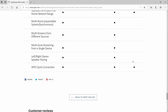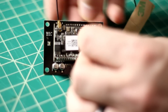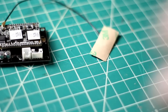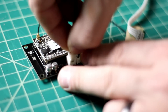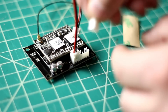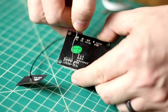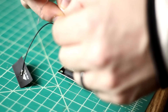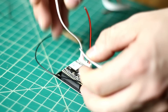Taking a look at the board, you'll notice there's not really much to it. There's a WPS button, a spot to plug up an antenna — it comes with an internal antenna, though you can also add an external one — and it has two JST terminals: one for power, which runs off five volts so we can run right off USB power, and the other is for auxiliary. There is a four-pin auxiliary connector, and that fourth pin is to run an external WPS button.